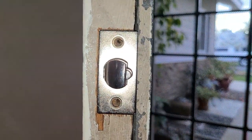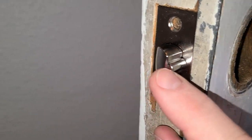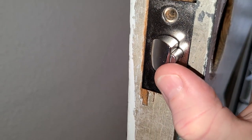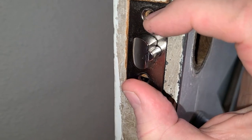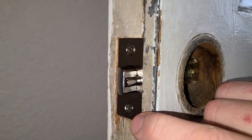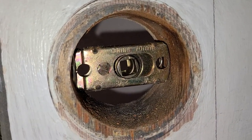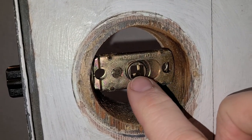And it's looking fantastic. Also something to keep in mind is whatever direction this flat side is — see this here, and then it curves over here — make sure that's the same direction as your old one was to be able to latch into place in the doorframe. With the screws in place, now we're going to come over to the middle section here, and this is where you can latch it to 60 millimeter or 70 millimeter length. We're going to go ahead and keep it on 60 for right now.